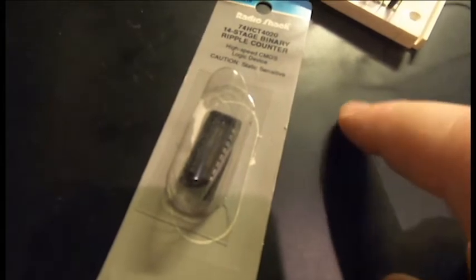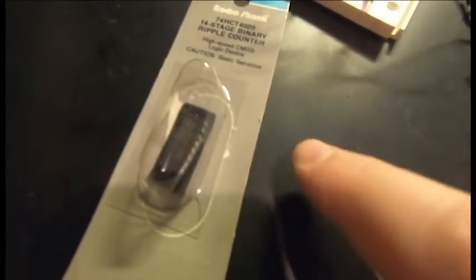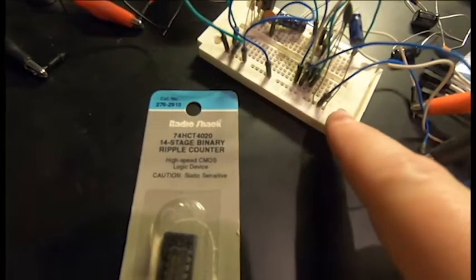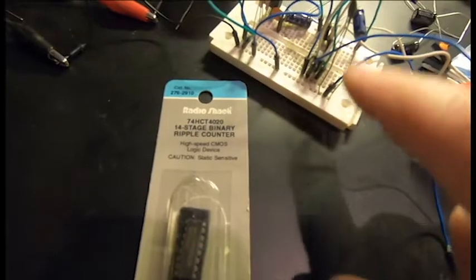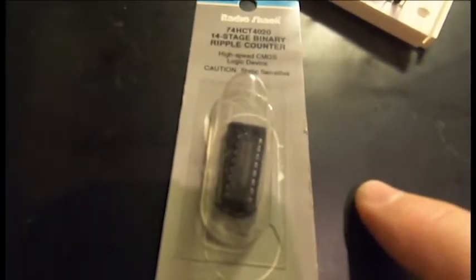That's when it would actually fire the sound, while this is going to only count up next time. So either that'll get you a backbeat, or I can just sacrifice one pin and have that be my one. There's no reason that the one of this has to be the one of this. And since this is going so fast, half of that, or even a quarter of that, will be fine. I can modify that until I find a nice bass tempo. Here it is running.